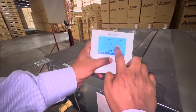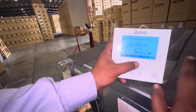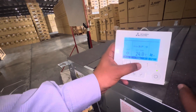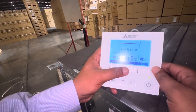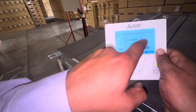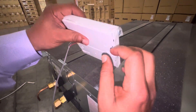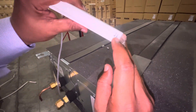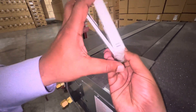You can see this symbol — this is the indoor unit symbol — which means currently the sensor is active on the indoor unit side. We need to change the sensor. Once we activate the thermostat sensor, the symbol will change to the thermostat symbol. The thermostat sensor is located in the wall where the air passes through — there is a sensor behind it.